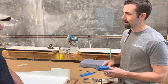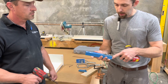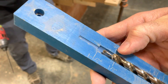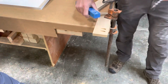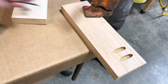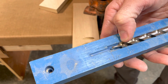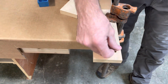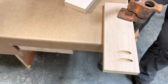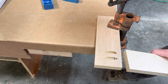Travis wanted to do a test that was really smart, so he got a scrap block of wood. We grabbed our drill bit — had it sharpened — and we set the shoulder so that it lines up with that three-quarter mark. We made our first cut and what's missing is the oval. You can see this one doesn't have an oval. So we pushed the bit a little bit further in, so the shoulder is about a sixteenth past that mark. On this second one you can see the oval is complete — a nice oval hole — so the screw when it goes in will be flush with the surface and sit there real nice.